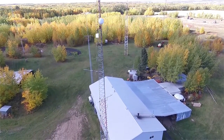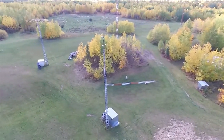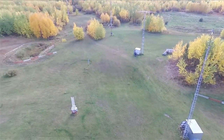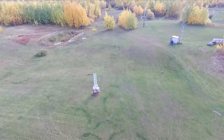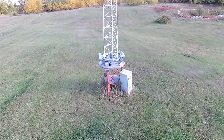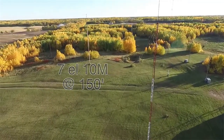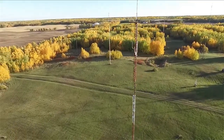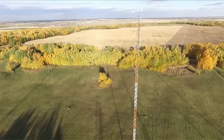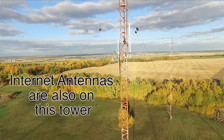And it's made from aluminum pipe and tubing. That tubing starts at 3.5 inches toward the center and tapers out to a little over 1/4 of an inch, around 1/3 of an inch. The mass of one element is 73 kilograms. That's 160 pounds on one element. It has a wind area of 2 square meters. That's around 22 square feet. Don says even before trussing, the element has a computer-designed wind survivability of about 100 miles per hour.